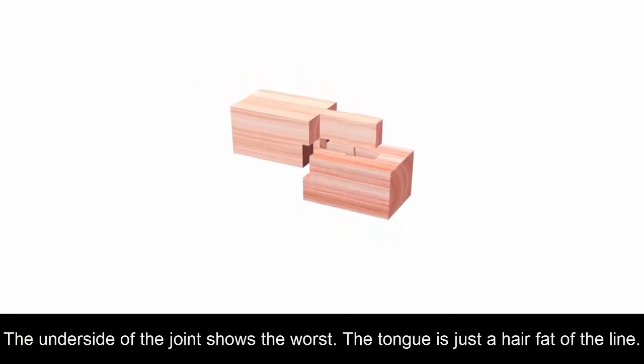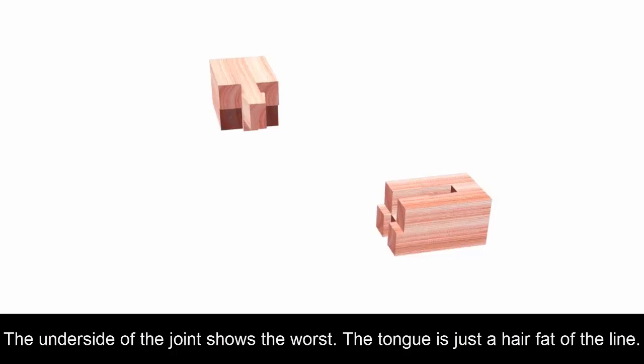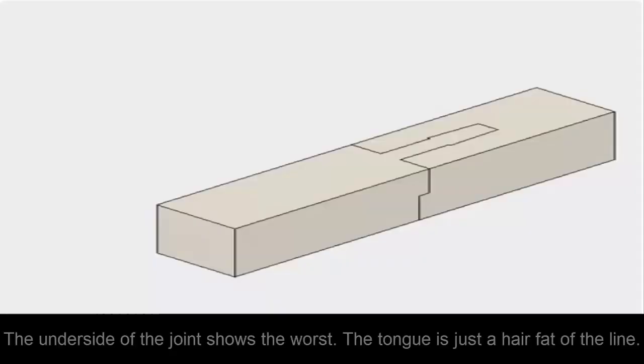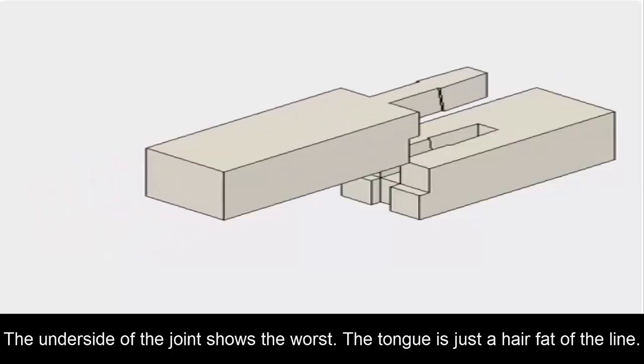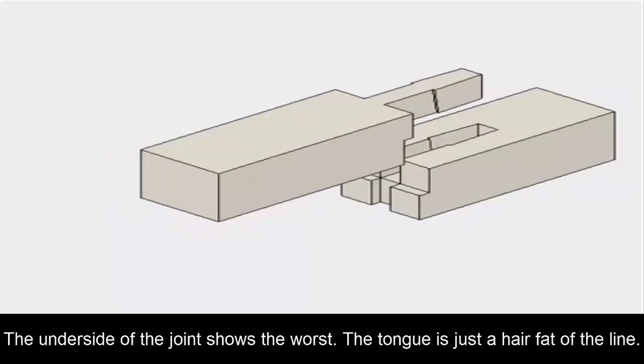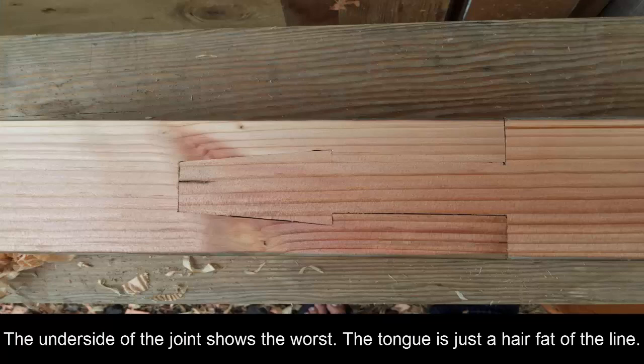By deciding to do as much cutting as I could right from the get-go, I had more sawing to do, but less drawing and extending of lines. Possibly that helped my accuracy, I'm not sure. Sawing is fun, so I'm happy with that decision. Finally, I cut this joint too tight. With my current level of skill, it would have been better had I allowed for at least one trial fitting. I got lucky, though the fit isn't quite as perfect as I would like.